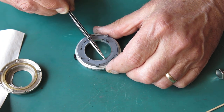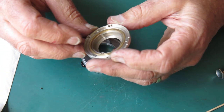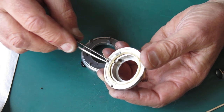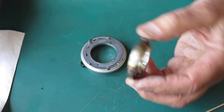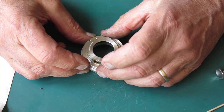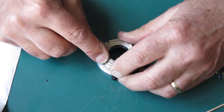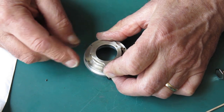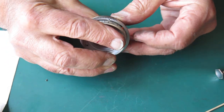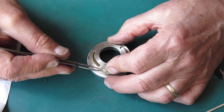I normally just line it up with that screw hole so I know where it's going to be. This piece only goes on in one direction — swinging that brass tab across to line up that hole, because the brass tab has to couple with that little fork. Lowering this over the three screws, lining up the little brass tab with the focus scale ring, checking the lever is not trapped underneath. That moves smoothly. Checking that the depth of field pointers come together in the middle evenly — and they do.